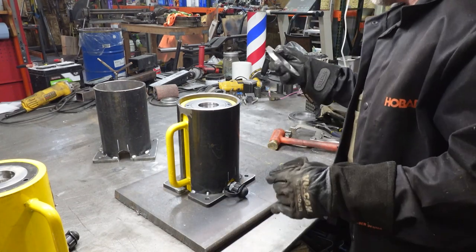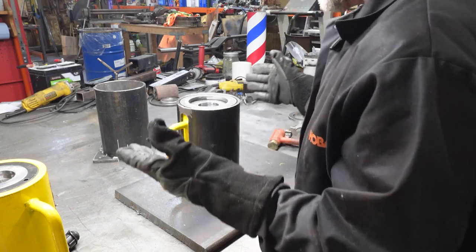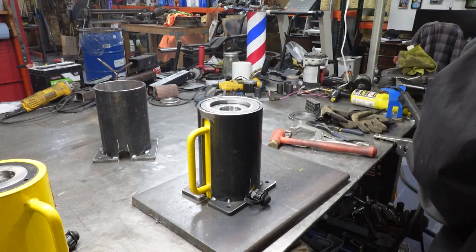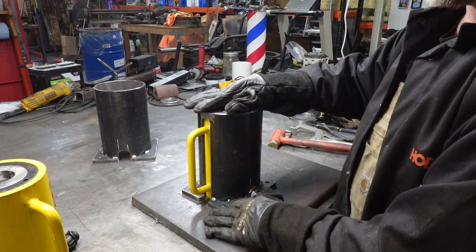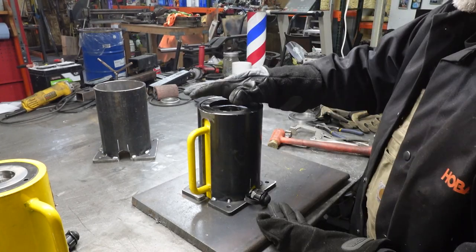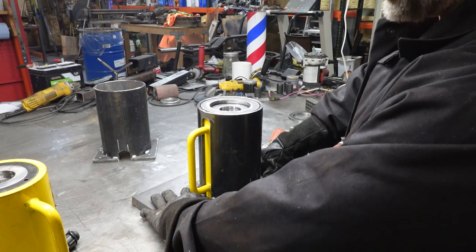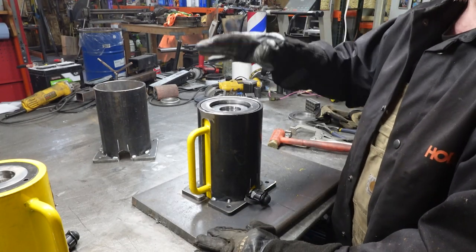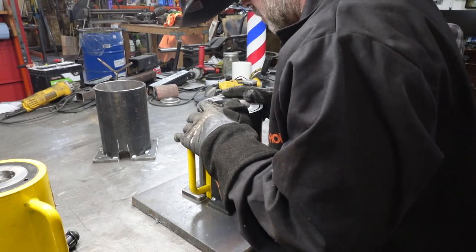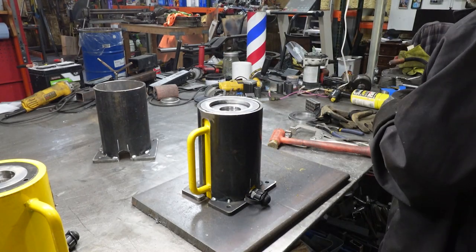And we take a ring and we just drop a ring in the top. And then we just kind of give it a little bit of weld, and that's it. These will be ready to mount after this. And doing it this way ensures that when the cylinder is mounted, because remember, it goes upside down. This is upside down right now. It's going to go the other way. That everything on this base will be flush against the beam. So everything will be drawn up snug right against the beam. So we'll do this. And we made the rings large enough that the piston can get out easily without issue.